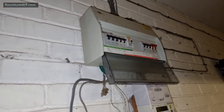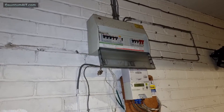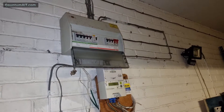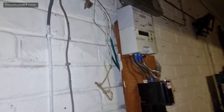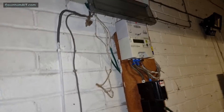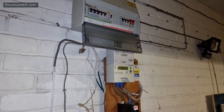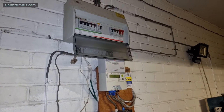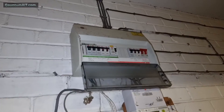Turn RCD on. Oh! Let's test it - staying on. Okay, you have solved it. Alright so I know it's kitchen-related - and what's in sockets in my room - because there's a little bit of drain from the computer. Everything gives a little bit of current drain to protect the electronics. You need a current meter to measure the drain so you can track down exactly what is causing it. But at least now I've tracked it down to the kitchen and what I've just unplugged.